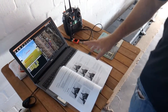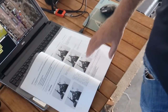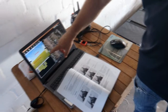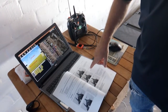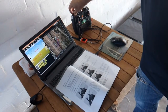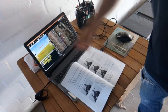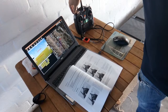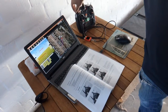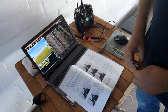Okay, hi guys, we've checked everything, just a few differences in the manual that I had to label. All flight modes are working. So there's the manual. And then I say, okay, one switch up. That's fly by wire B. Okay. That's that one there. Going back to manual. And let's see, we go RTL. Two switches away from each other. RTL, then it's the back switch forward. And that went forward. Auto. Auto. All working. And the stabilization one is one switch at the back, the second one in the middle, stabilize, and back to manual. So there are quite a few alterations in other places, also in the manual and links, so you need to work quite thoroughly through it.